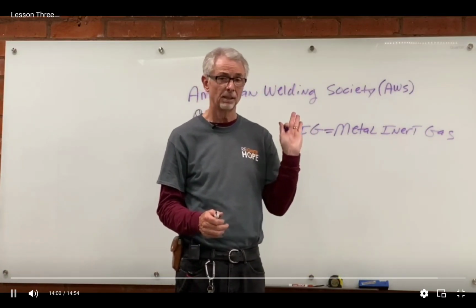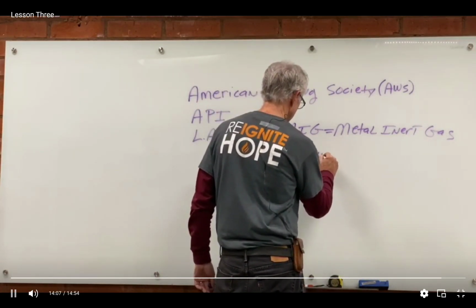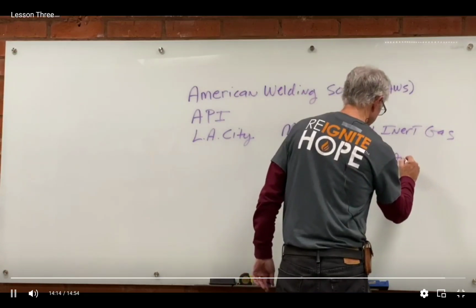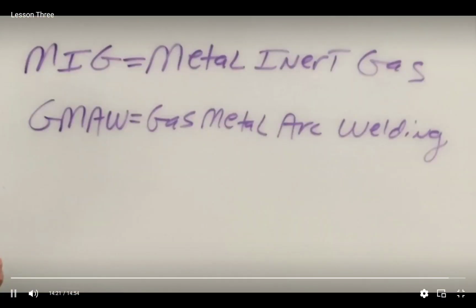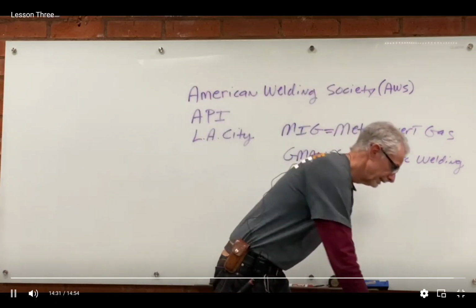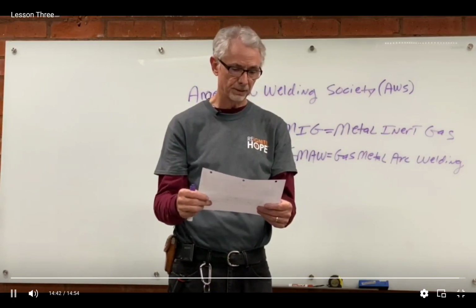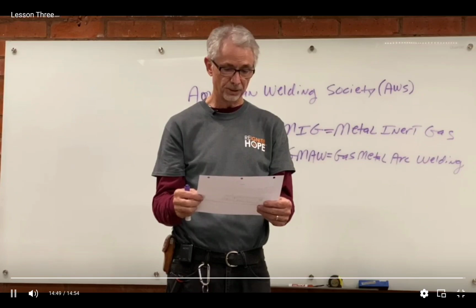Now, MIG welding is sort of the slang term. The technical term is GMAW, which is gas metal arc welding. Again, gas is our shielding that we're using, argon and CO2. Metal is our wire, and then it's an arc welding process. That's the technical term for it, GMAW, and that's question number 4. What does GMAW stand for? So once again, list the 5 common joint types, list the 4 joint positions, what does MIG stand for, and what does GMAW stand for.